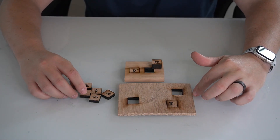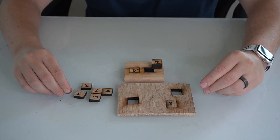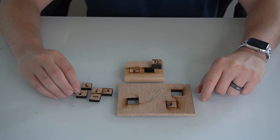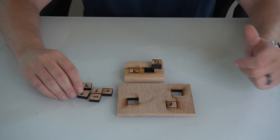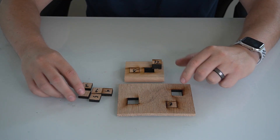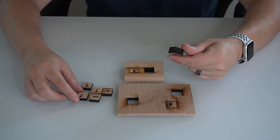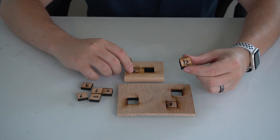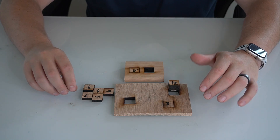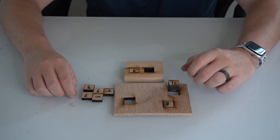You might have noticed these pieces in one of my other videos where I was talking about laser wattages. The main thing I wanted to show here is that with the mesh bottom you are able to cut through thicker materials without issues at the bottom. I had an issue with a test using the plain aluminum bottom which was pretty much a failed attempt — the bottom was completely burned out and the part was unusable. But with the mesh bottom I was able to get through a quarter inch oak and half inch oak without too much of an issue. The half inch does have a little bit of burn, but that's with 12 passes so that's expected. The mesh allows air to circulate more and makes these types of cuts a little bit safer.